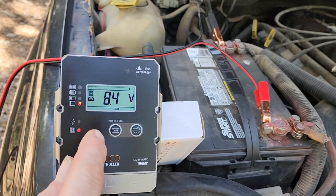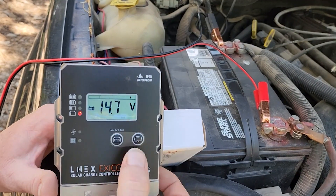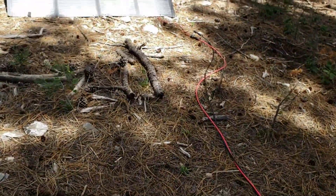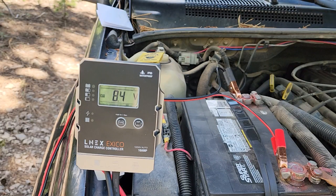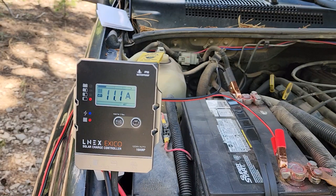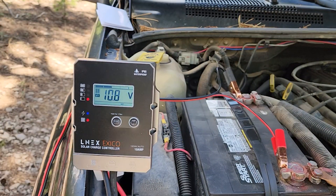As we connect it to the battery, you can see our battery is at 8.4 volts — very, very low. You're also going to want to select your battery type. Hold down the battery indicator until it blinks and then cycle through: wet, AGM, calcium, lithium iron phosphate, lithium. We're going to go with wet, which is another way of saying lead acid. I'm connecting our solar panel — this is a Librid's portable solar panel at 240 watts. As soon as I connect that, we go from 8.4 volts up to 11 volts because we now have 10-11 amps of power running into the battery. You can push this button to switch the display from voltage to amps — we're at 11.1 amps — and press again to show amp hours put into the battery, and one more press takes you back to battery voltage. We're going to let that run for about 15 minutes and see what happens.